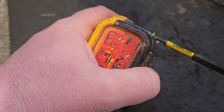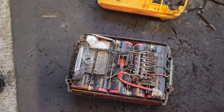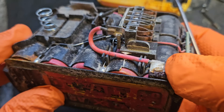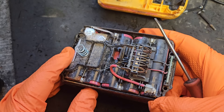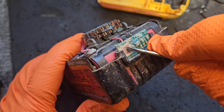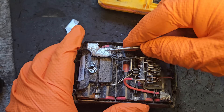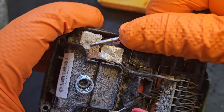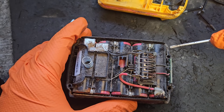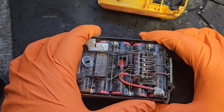To go further with this we're going to have to open this battery. I need a Torx T10 to unscrew these. This is an old battery so when I open it I'll probably put on gloves. First of all, that doesn't look good — that rust there, look at that, there's a lot of corrosion. The battery's dirty which you'd expect. I don't know if that board's still working. Got to look at this here just to see if the connection's still attached — yes it is. Sometimes if there's an overload it can blow out that connection. If we had five banks of cells and that was blown out, we'd probably be getting about 16 volts, so that was a suspicion, but the connection seemed to be all connected at the top.